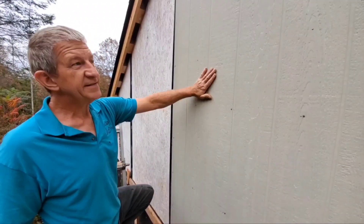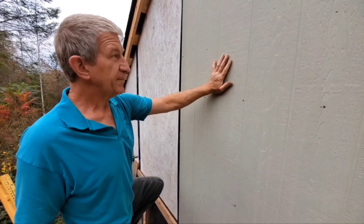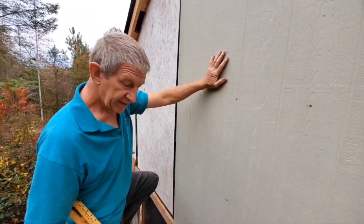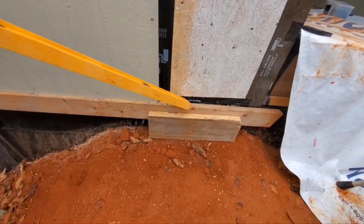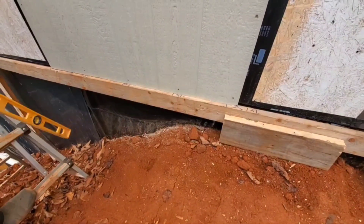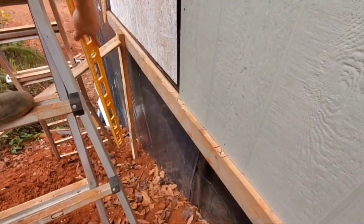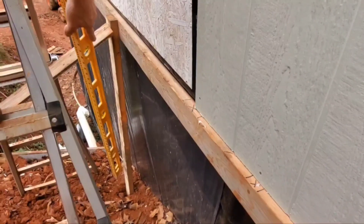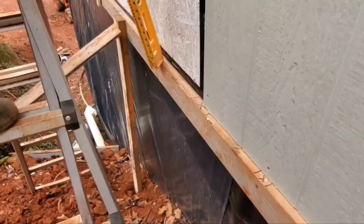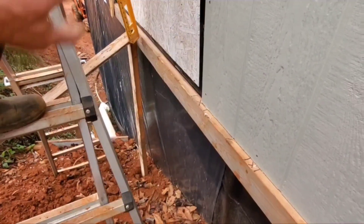These big sheets of Allura cement board are relatively heavy — four feet by eight feet. Once I put one up I don't want to use all my strength to hold it in place, so I put this board down here sitting on dirt. I packed it down tight so it won't sink. There's nothing to nail into except concrete, and I don't want this board permanently on here. I drove a two-by-four into the dirt, pulled it up, put dirt in the hole, drove it back down a couple times to make sure it was nicely compacted deep down. Then I took this board, pulled it up to the right height, and put a screw in it.